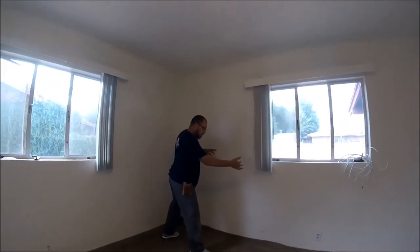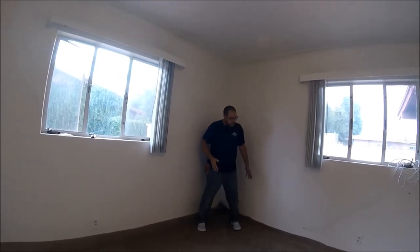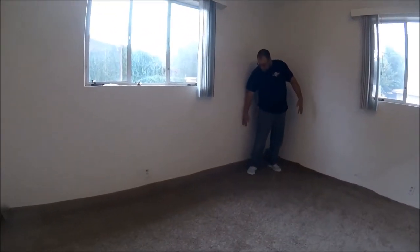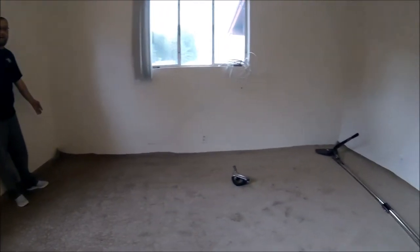So if I did my first couple long ways out of the closet, like people say you should, and then stretched the complete wall over here, by the time I'm coming back here lengthways, where I need to get my best stretch, this whole wall's tied off. So I'm not getting much of a pull when I get within two or three feet here, finishing up long ways, because this whole wall is tied off right here.